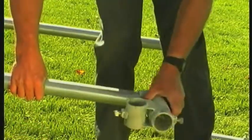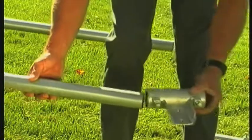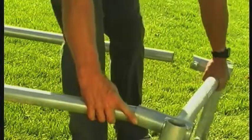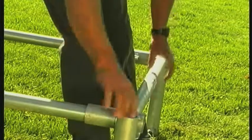In the case of a 7-foot wide L section, the installer is shown here sliding the post hole corner bracket onto the frame pipe first, then the C-channel corner bracket next. Then you will install the end bracket onto the frame pipes flush to the end bracket sleeve. Attach the bent arm corner bracket onto the end bracket.